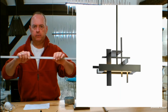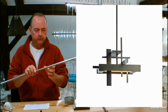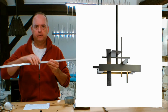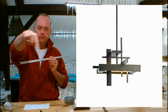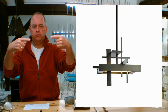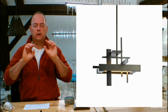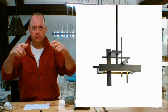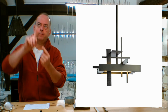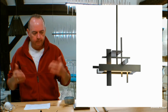This is an LED strip. It's called a light bar, and there are embedded strips of LEDs in this. I wish I could take it out, and I don't think I can, but it gives you the idea what's in this. You'll notice there's a frame on this fixture, and embedded in the sides of the frame is this kind of idea. How these LEDs work is they're pushing light toward each other from the sides. They're going into a frosted acrylic diffuser in the middle. It's hitting all of the little frosted parts, and that's reflecting and refracting light up and down. So you get a lot of light up, a lot of light down, and that is the magic of how these LEDs work.